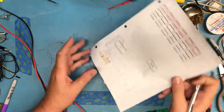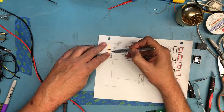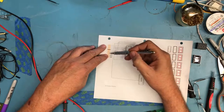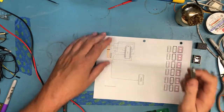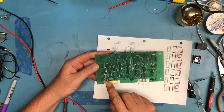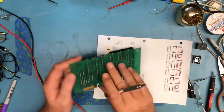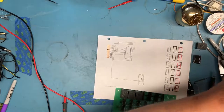So what we've basically determined here is there are 8 inputs here, which are going off to the 8 inputs of the bus driver here. There's some kind of an enable that gets passed to one of the pins on the LS-138. And we've basically captured at this point all of the inputs here. Now it becomes, how is this connected to this? And the easiest way, I think, to determine this is simply going to be by doing this.